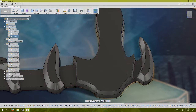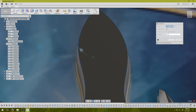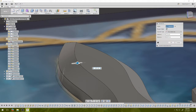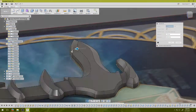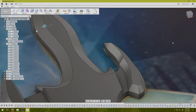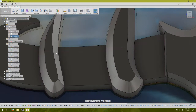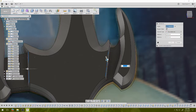I think what I'm going to attempt to do is a chamfer on these two edges. I can do 1.5 — but I think I actually want to do two distances so I can pull this in more. If I do that more, that reflects better the top. I gotta make sure I can get a printer head down through here. Always do your fillets last — oh my god, do they break stuff. Never do your fillets at the beginning; you will regret it.